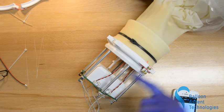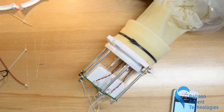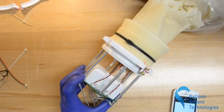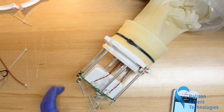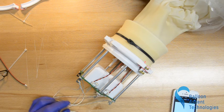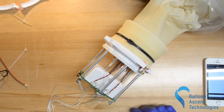And you'll see once the valve starts pressing on its limit switch, it then goes through a sealing routine just to make sure that there's a good seal on the bottom there. So the valve's closed, everything's looking good there. Before we get to inflation, we'll of course have to open that valve to let your lift gas flow in, but the valve unit's on and ready to go.